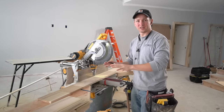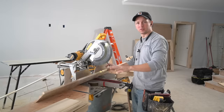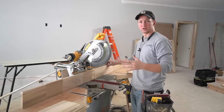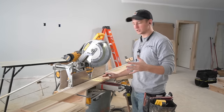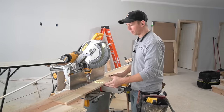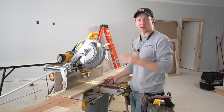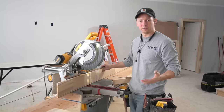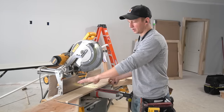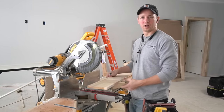I started the video by saying we'll get more accurate cuts by using the base of the miter saw and the length of our wings as our frame of reference when cutting vertically, because that better represents how the piece is going to sit on the floor — we're stretching it out over a much larger area. Don't take that to mean you can't cut pieces flat and use your miter saw fences as your frame of reference. Many times as I'm cutting, I'm flipping back and forth, especially on my straight cuts — sometimes it's just easier to let it lay flat and make my cut with the slider. I'm just making the point that as a general rule, an eight-foot frame of reference is going to be more accurate than a 12-inch frame of reference when you're dealing with imperfect material that has crowns in it.